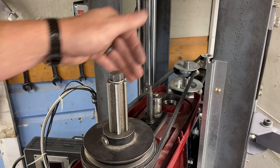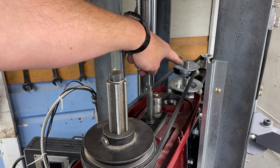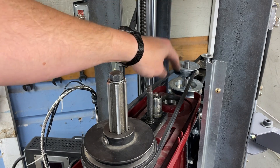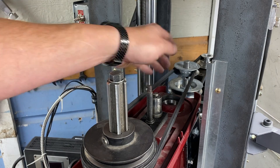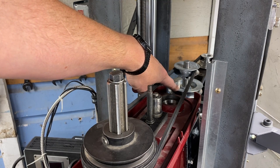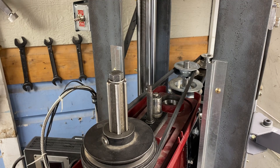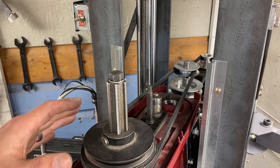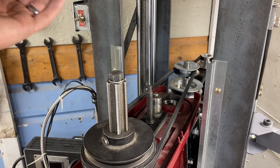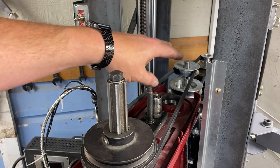What's really cool about this setup is I can swap out the pulleys. If I want more speed, all I have to do is remove this pulley — which is as simple as loosening a set screw and lifting it off — and replace it with a same-size pulley to make a one-to-one ratio, giving me more high-end speed. On the flip side, if I put a bigger pulley down here or a smaller pulley up top, I can slow things down even more. There's not a lot of times I'd need to run the mill at less than 200 RPMs, and unless I'm using a really small end mill I'm probably not going above 1,200 RPMs — but in the shop, you never know what project is going to come up, so it's fantastic to have that option.